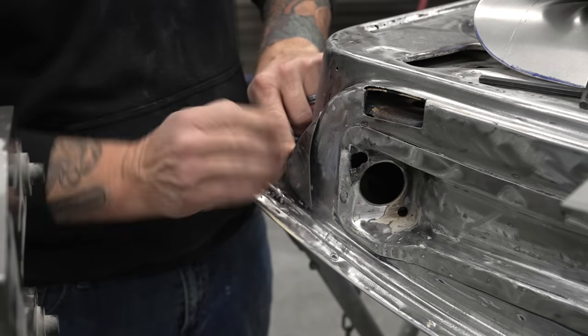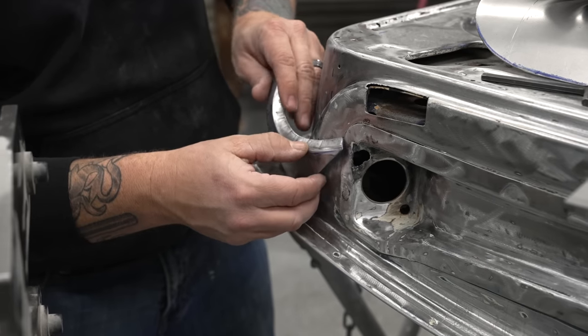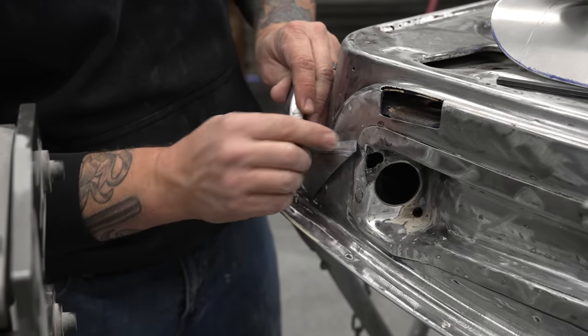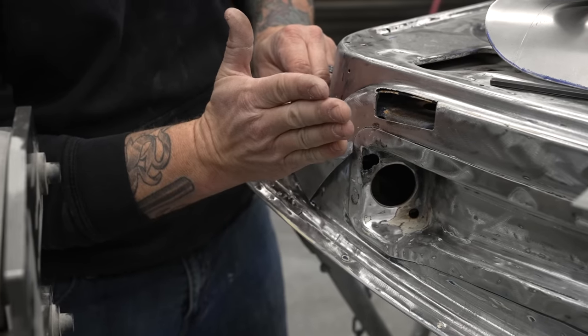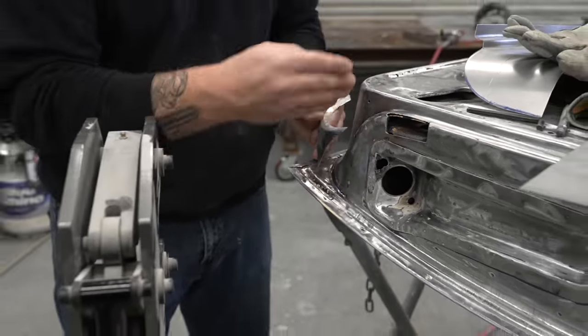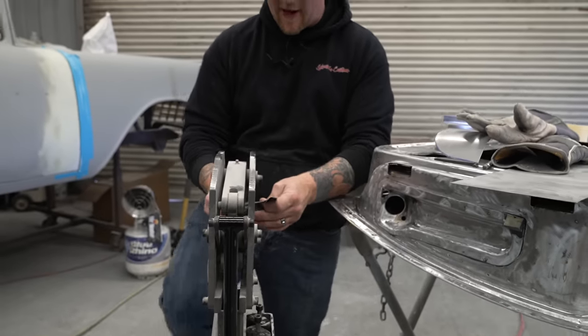Well, in order to get this nice and flat, I need this top edge to bend out. So if you're looking at this edge, we are going to then stretch right in this area only, and it's going to start straightening out so we get this back flat. It's a constant deviation of a little shrink, a little stretch to get things to line up where you are.